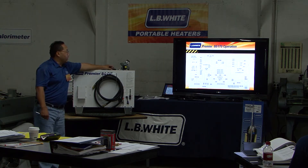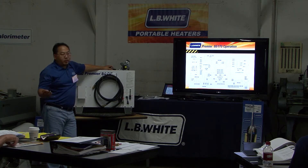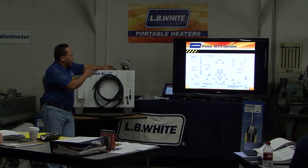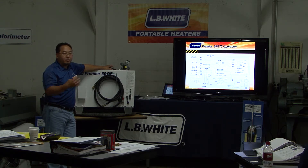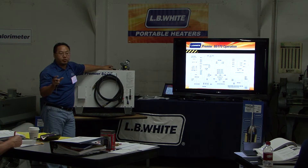The wiring diagram on these guys is very similar to the 400. Everything goes through the control board, goes through the air-proving switch cycles, and all the sequence of operations is basically the same. It does have a pre-proving cycle — it doesn't stop the motor, but it does that little five-second check. It's checking for the motor and checking for the air-proving switch. That's what we kind of call a pre-proving cycle.